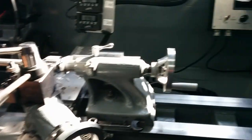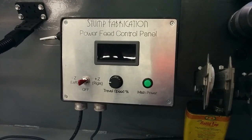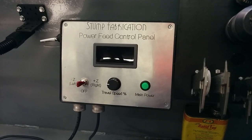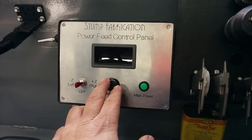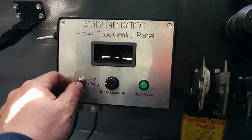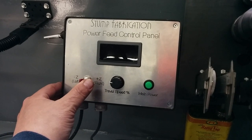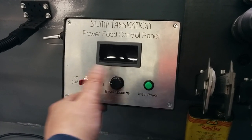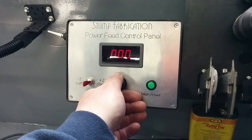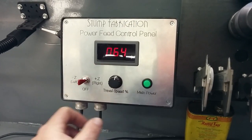I've done a few things I wanted to show you. Most recently, I just got done with this power feed for the Z-axis with a lead screw. It's just a little project box I got from RadioShack. Inside is a 12-volt power supply that puts out 10 amps, and I got it from eBay along with this motor controller — it's like a one-package unit, also good for 10 amps. I wired up a little double-pole double-throw toggle switch to reverse polarity. So Z negative would be carriage left, Z positive carriage right. The travel speed is a digital indicator on a 0 to 100 scale — not necessarily RPM related, but pretty much infinite in that range.